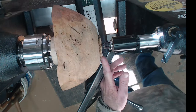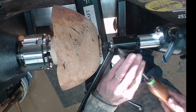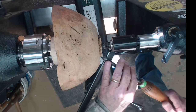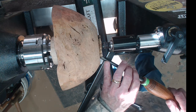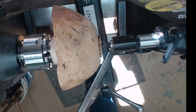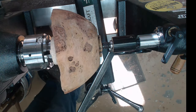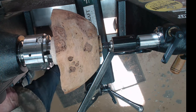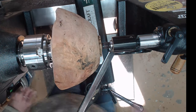I think I've got enough meat on here to clean this up. I'm going to use my detail gouge — 3/8 inch — it's got a lot of meat, leaned over against the rest, and I can get into a corner. It's very difficult to get a nice crisp corner with just a bowl gouge. Let me put on my face shield and get going. I need to go back and reset the pulleys to bowl setting.